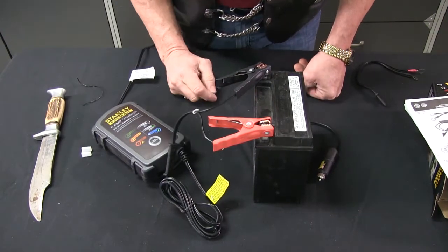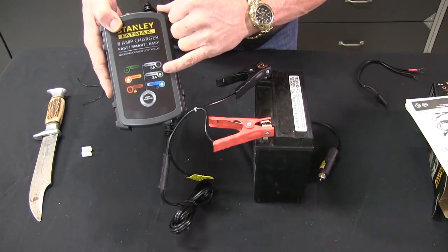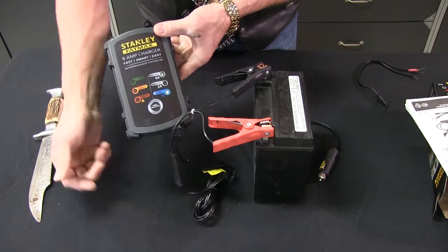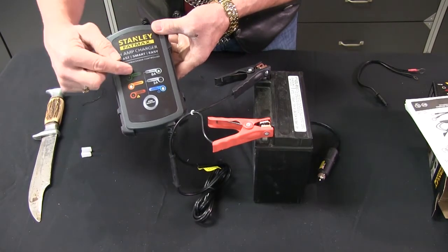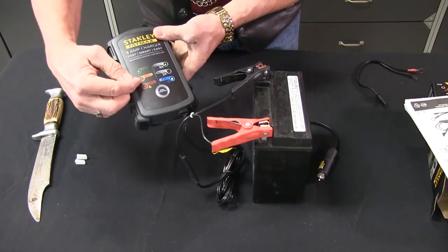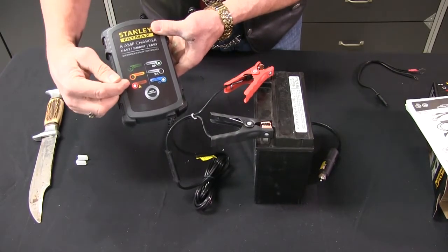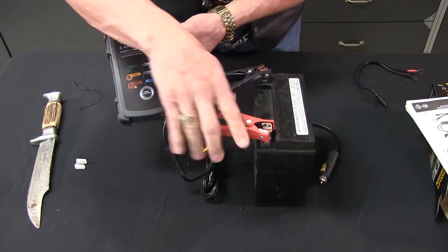2 amp is your maintainer. So right here, this says 2 amp — that is actually going to be the maintainer if you're just going to use it as a maintenance thing. Put it on there like in the wintertime when you're not really riding your bike, or if you want to keep that battery juiced up on a tractor — put it on the maintainer, which is 2 amp. If you want to charge it, you're going to hit that again. Now we're in the charging mode and you see these lights just pop right on through here. When it's fully charged, this green one's going to come on when it's fully charged up. And if you got it hooked up wrong, this is a reverse connection indicator — it's going to let you know. So let me hook this up wrong just for the heck of it and see what happens — maybe we'll blow up, I don't know. There — the red light just came on. That tells me I am hooked up wrong. So undo that, hook them back up the right way like they're supposed to be, and we're charging back up.